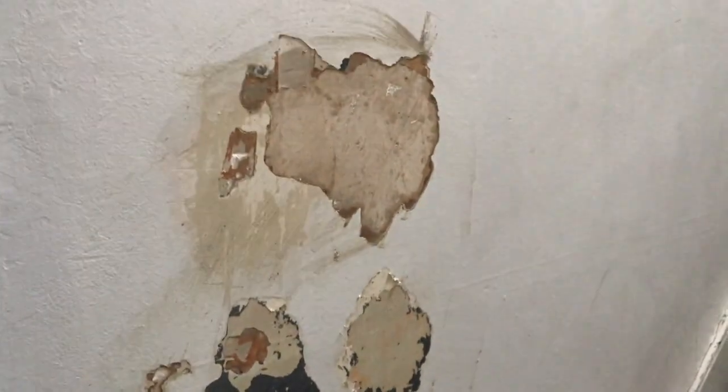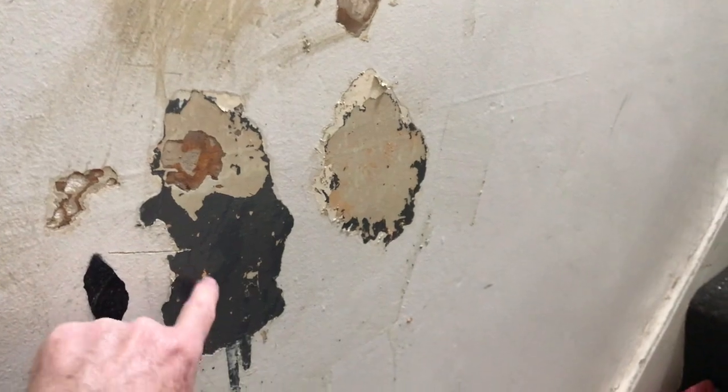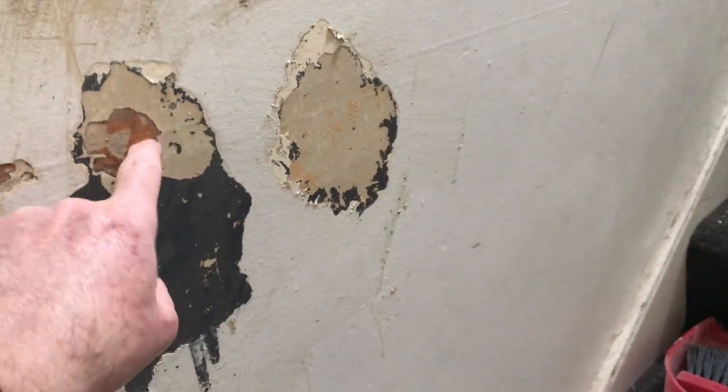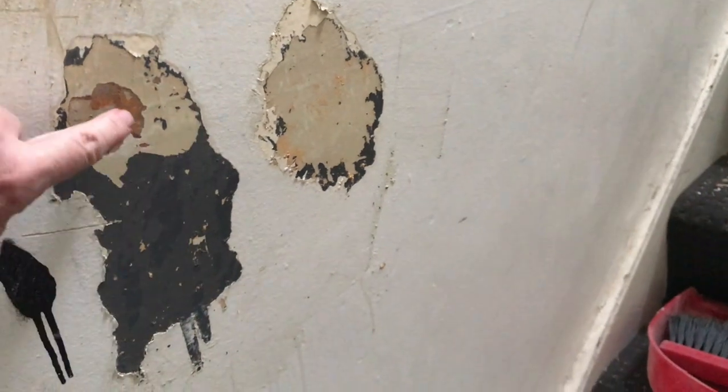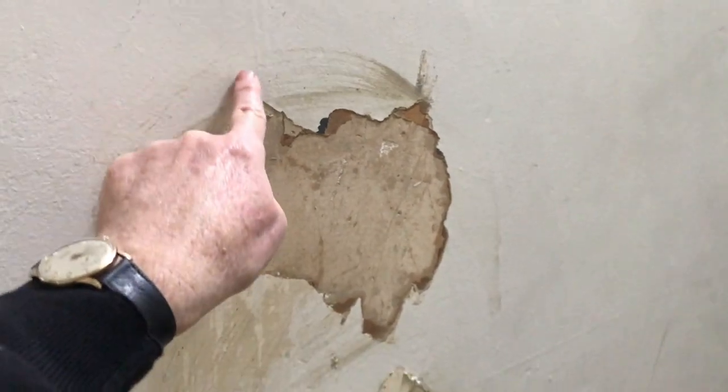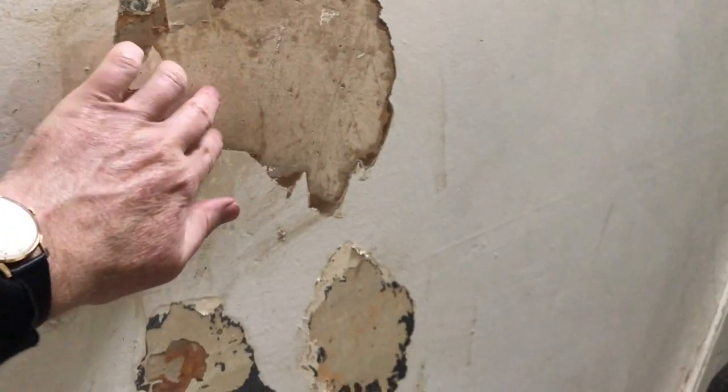Here is the hall sample. I got excited when this dark colour turned up, but that's actually quite a recent color. Underneath is this sort of creamy colour — but it is wallpaper. These marks across here, this kind of tanny bit here, is the wallpaper base, and when you get up here the stripper took all of the surface off. You can see that line came down here and it disappears under the plaster — the plaster is completely smooth. So what that does mean is that our hallway was not ashlared, it was in fact wallpapered. You can see where the lines don't transfer underneath to the plaster level. Unfortunately that does mean that someone — probably me — is going to have to strip the whole wall so we can get a smooth surface again.